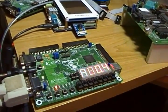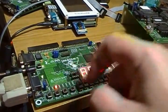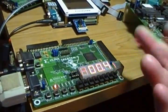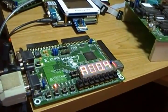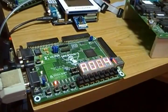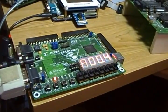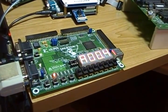In this case I have a halt instruction, but I could just as well have been single-stepping by activating a particular mode, where every push of the button executes one instruction and I'd be able to step through and look at the program counter, instruction register, and accumulator. The instruction set is fairly regular — nothing magical about it. Not like the new CPU I'm working on called Wonder, which is pretty much completed and has a very novel, interesting 32-bit architecture. This one is pretty much straight out of the 70s.